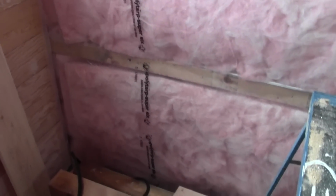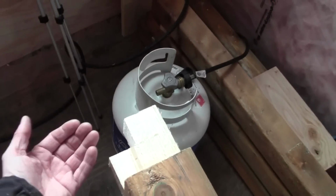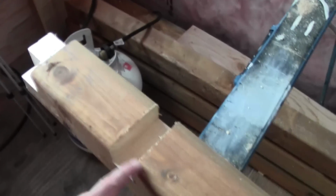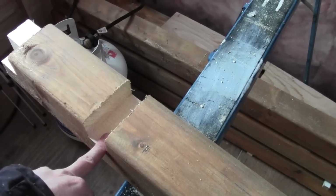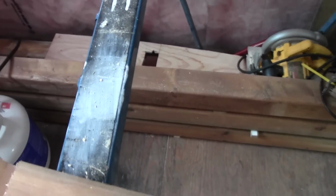So the cross brace between that spans the room, or the half lap, would sit in here, and then my floor joist would sit in here and connect onto this. So basically these cuts should have been cut on the side here to go back and forth that way.